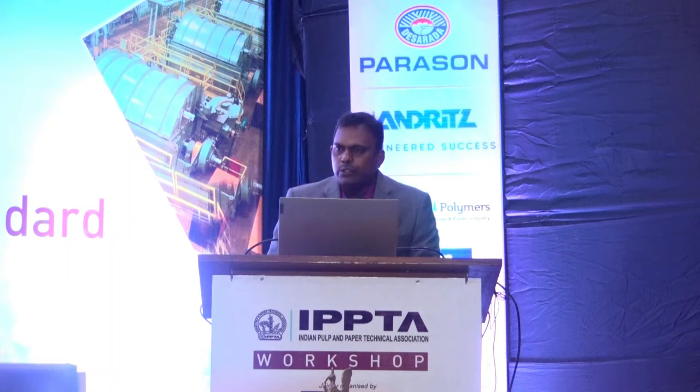It is important to know that if you store the bagasse for longer periods, it will have severe color degradation, the yield will be less, and it degrades the fiber properties. That's why we should not store it for a long time. It is recommended that we use it within 3 to 6 months. And as I already told, we want the bagasse to be stored in a wet pile, with around 80% moisture content.